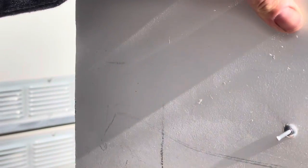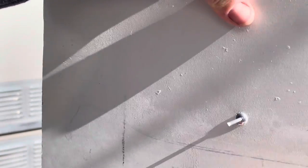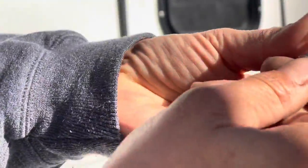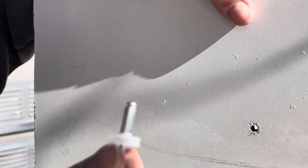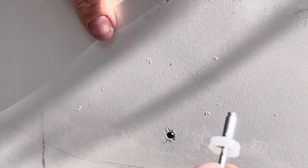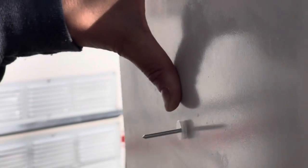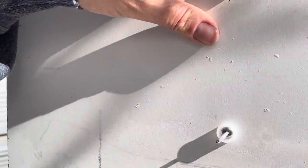One thing I forgot — I was not including the snap cap. To get a better gauge of the depth I should put the snap cap on. You don't really need to worry about butyl for measurement's sake because it's going to squish really flat anyway. With the snap cap on it's still about the same, and putting my acorn nut on that's going to fit well. So now I have the right size rivet.